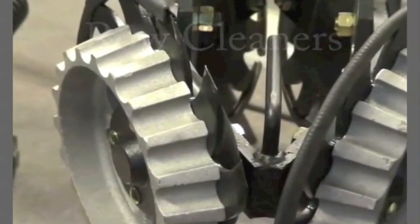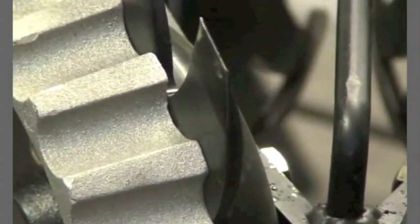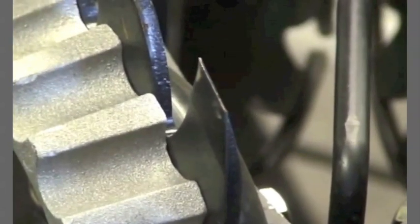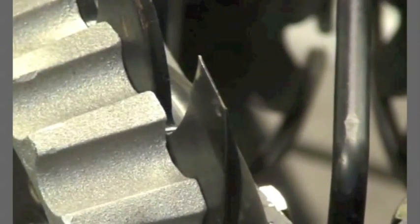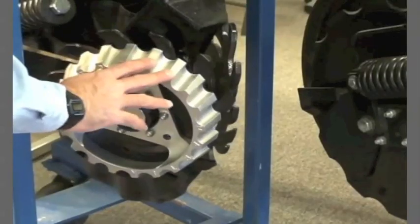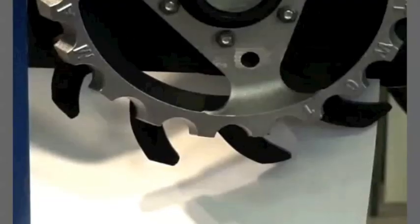There are many row cleaning wheel variations. The sharp tooth or tiger claw design is very aggressive and, due to the width of the cutting teeth, can move a considerable volume of soil. As long as the teeth are sharp, they will cut residue. The curved spiked tooth with treader wheels will release residue somewhat easier than the straight spiked tooth. Where cover crops are large in size, they will not wrap around the row cleaner wheels as easily when this curved spiked tooth design is used.